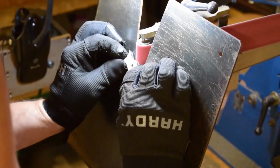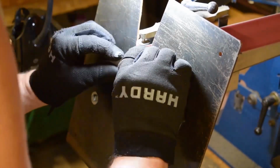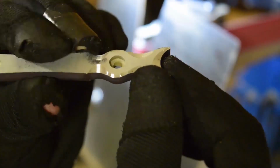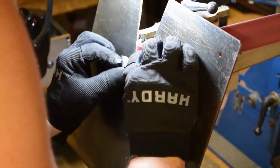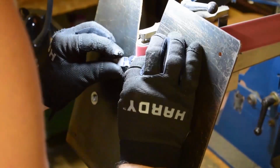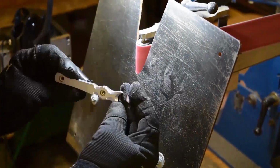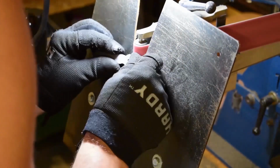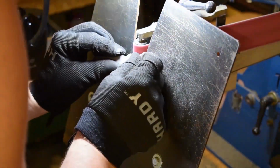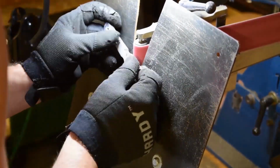On my typical parts, like the fantasy sword that I had done, it's where I use the metal blackening agent. The Birchwood Casey, sorry about that, I kind of went brain dumb. The Birchwood Casey, it's basically a gun bluing solution, and it makes your steel a dark blue, almost black. And I like doing that, and then hitting it with some sandpaper after that, and it makes all the little details that you've ground in just pop. All the deep spots that you ground stay nice and dark, and all the high spots are nice and shiny. It just gives a different look and feel to the part.